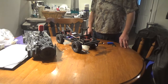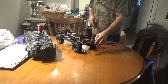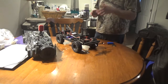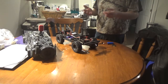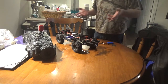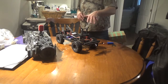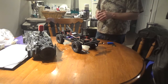I'm happy with that. Now the problem I ran into, I forgot to mention that, with the switch. Normally it's at the motor wires. In my case it was the switch. My positive wire kind of like fell off the switch contact, literally. You could like push it right back in the hole. I was like, well, you kind of gotta watch it when you buy this stuff and go over the solder contacts. So I resoldered it and the negative wire to make sure, check the other wires, they were okay.